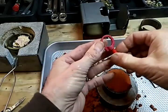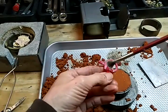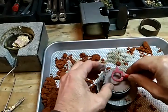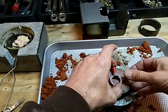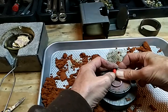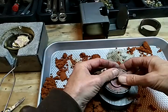Now we take and I've got to find my talc. We're going to talc the side of the piece here, get that really good. I'm going to do it like that. This is a wax so I've got to really kind of push down very easy — I don't want to break my wax. This is a soft injection wax.